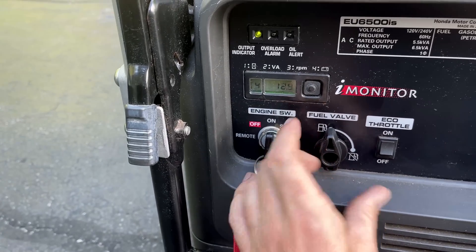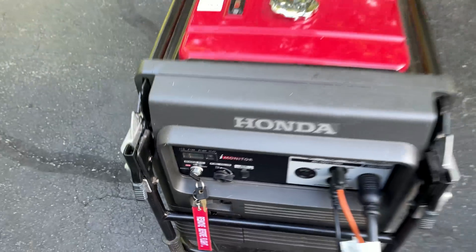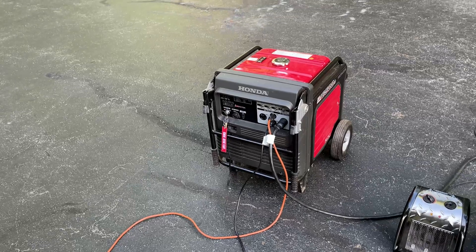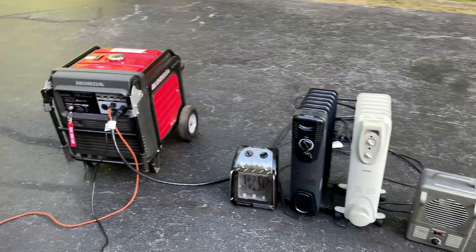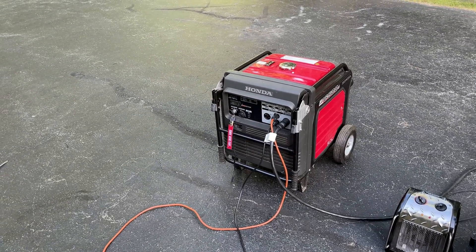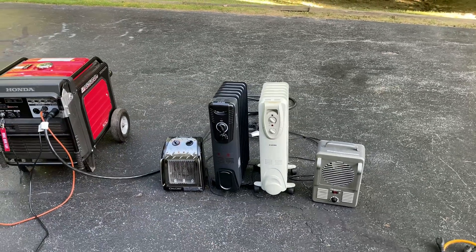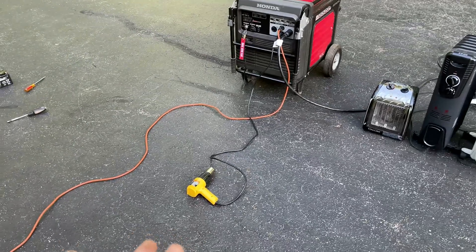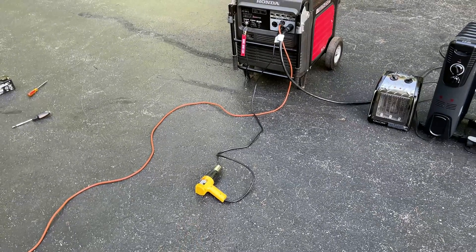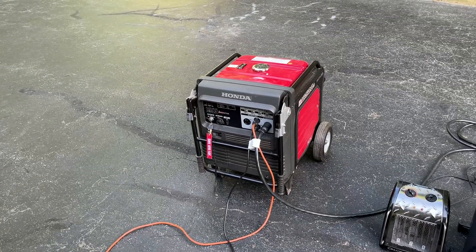That battery voltage came up quite a bit — it's almost at 13 volts. Believe it or not, I have never overloaded that before, so this is a first for me. But it's not a bad thing in a controlled scenario like this. You do want to stress test your generator and see what it's capable of. In my case, I assumed 5500 watts was pretty much it continuously, but I pulled 6000 watts continuously — no problem. I added another 1500 watts and it shut down. After I reset everything I tried it again, then put it on low to add another 600 watts, so it was pulling 6600 watts continuously on a 5500-watt generator.